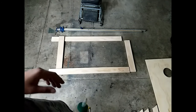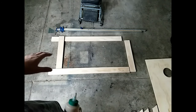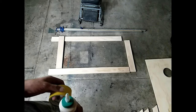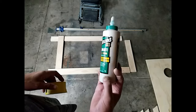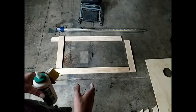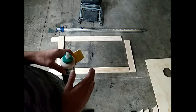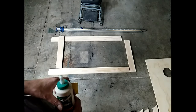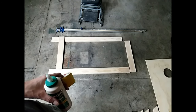After some light sanding — I went over it with 120 grit — I lay everything out. I make sure my clamps are available and make sure you have some tape. I don't know if this is going to be needed or not, but I'm going to use it for squeeze-out so I don't have to re-sand it. I use Titebond 3 — it's my go-to because it is waterproof and made for using outside. You lay it out and make sure these little pieces where the bolts go are facing upward. It's very important — if one's facing up and one's facing down the whole thing is pretty much ruined and you have to start over.